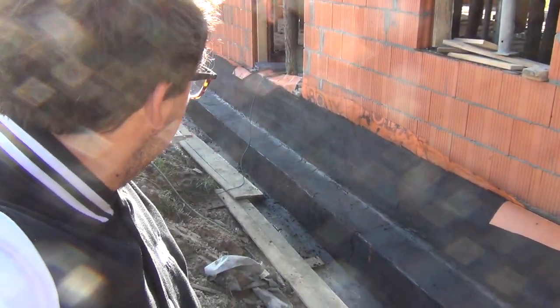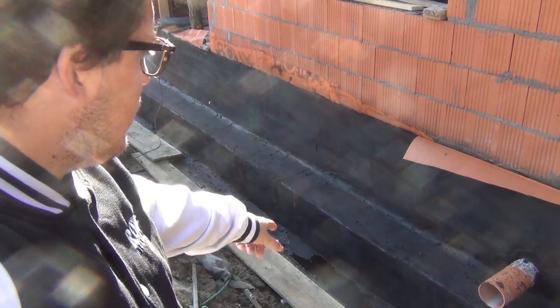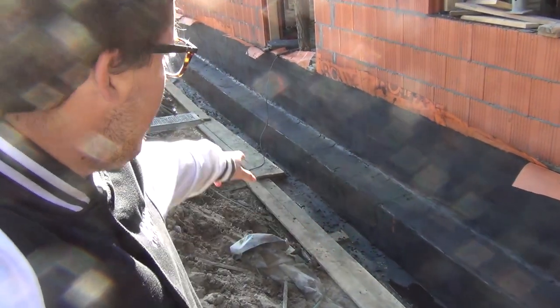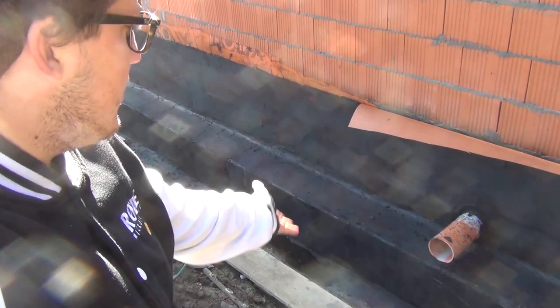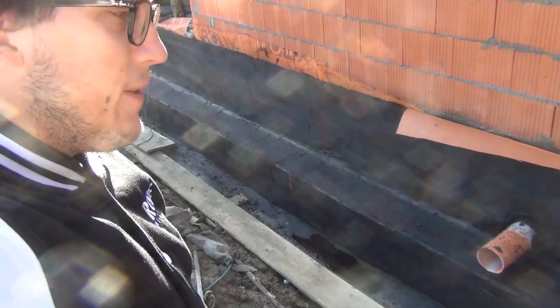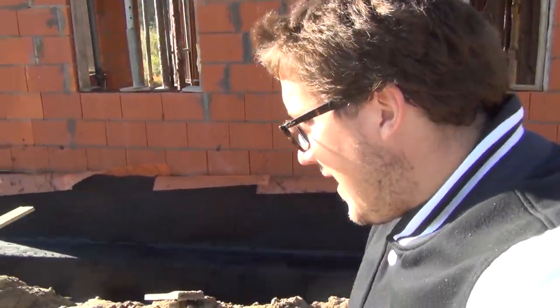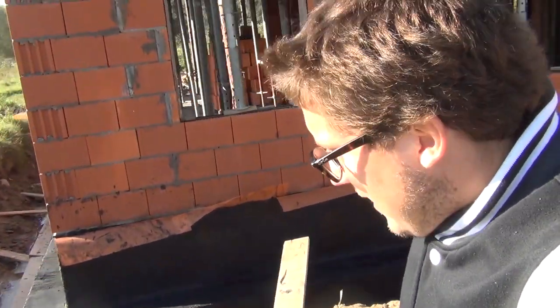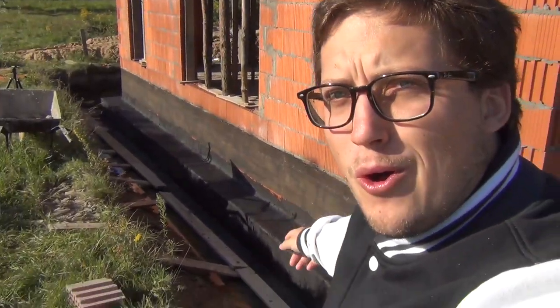Today I'll cover this area, get all the excess water off the foundation so it can dry, and put on the second layer of bitumen on the tar paper and also on the foundation foot wall and the top of the foundation foot. It will be fun — I'm alone today because it's Monday. Over here is the same, and if I get time I'll probably also do the netting on the wall just to get started on that, but we'll see how it goes.